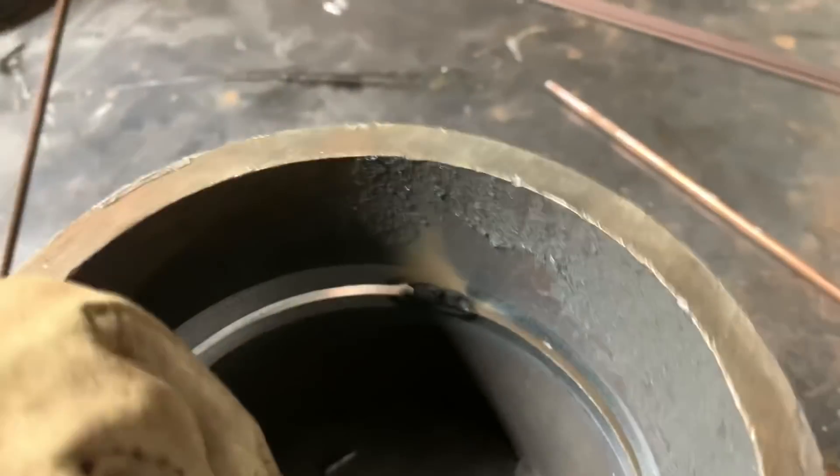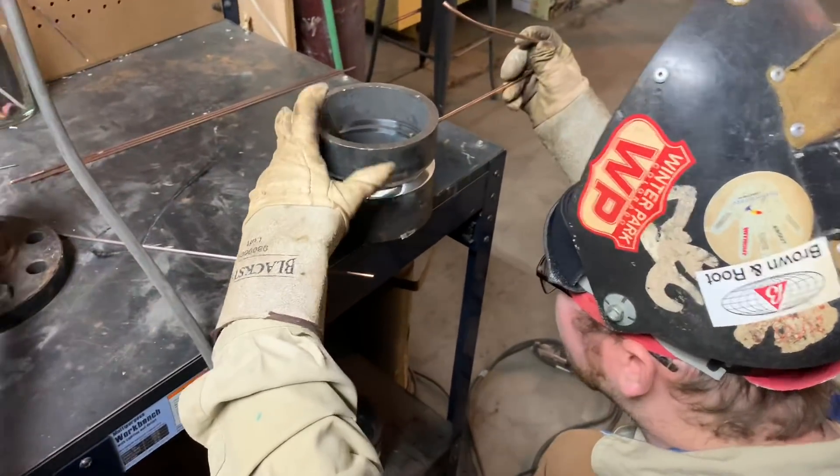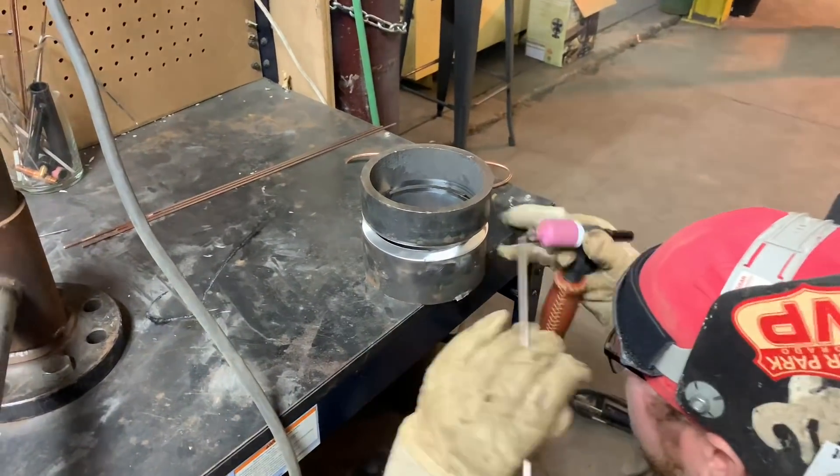You can see the whole process here and what it looks like. And this filler wire — it's 70S2. We took a little Scotch-Brite and shined up the wire a little bit, which helps with the silica, lets it run a little bit smoother, gets some of that copper coating off of it.